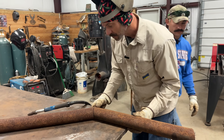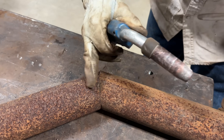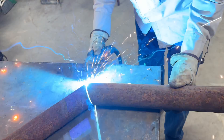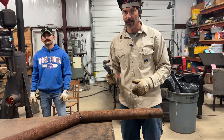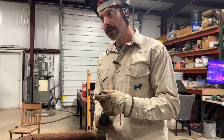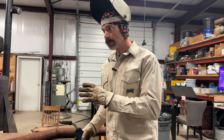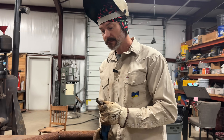Your fit is super tight right here — you're not gonna really get any penetration on that rust. So scoot it back just a little bit, create your little gap. You really want to weld on the clean inside. That's it, this thing's done — all I need to do is weld it up. I'm not very familiar with MIG guns as far as my welding career, but the settings on the Miller 252 are 17.8 volts and 216 wire speed. That seems to weld most anything and it welds this really good. It's hard wire with gas, not flux core — that's why it really shocked me how good it welds this stuff.